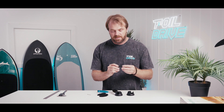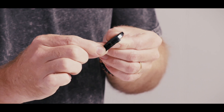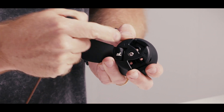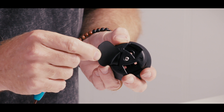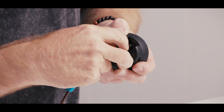What we've found from more research and talking to customers and getting some hubs back is that this little cap that goes on top of the injection molded hub — which is also injection molded — sometimes has a tiny little plastic ridge that is very thin. When it is screwed down with the center screw excessively tight, it pulls down so far that when the blade tries to fold back, the hub section of the blade actually gets jammed up underneath this tiny little lip and sticks. A solution is to back it off half a turn, pull on the center star a bit, and if it then flicks in and out freely, you've solved the problem.